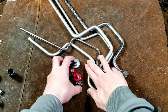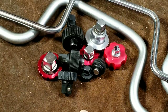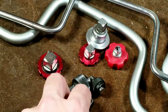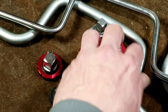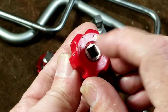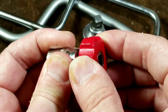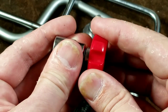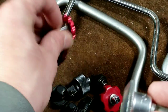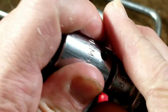Some of these are purpose-built finger spinners, and some are actually anvils out of ratchets. To tell the truth, I like the anvils out of ratchets far better than any purpose-intended thumb spinner. I do like this little quarter-inch one — it has a wide thick wheel and a really nice solid detent. Most thumb spinners allow you to drive them with a ratchet so you can break the fastener loose and then just spin it out. You want ones with really deep cutouts so you can get a grip even with oily or greasy fingers, and a wide surface so you don't pinch your fingers.